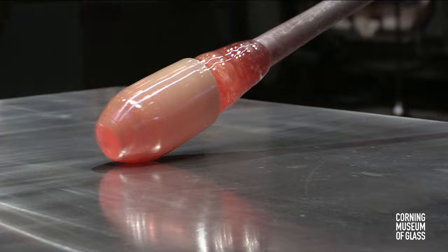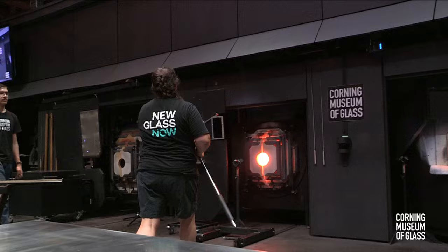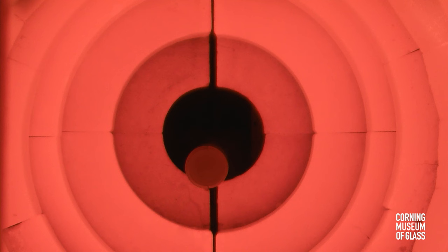Catherine is centering and shaping up that glass now on the marver. Sometimes it takes a few heats to really get this color bar melted in, because when you first apply that overlay, there's a decent amount of texture there. We like to melt that texture away because we'll be taking a second gather of glass over this, probably